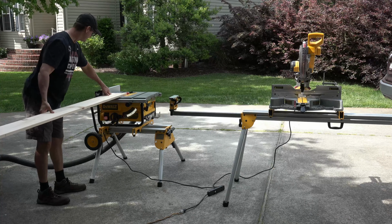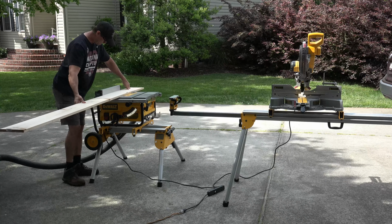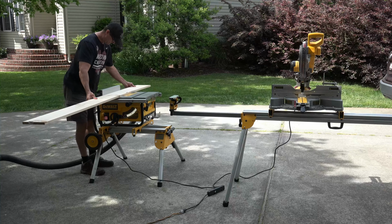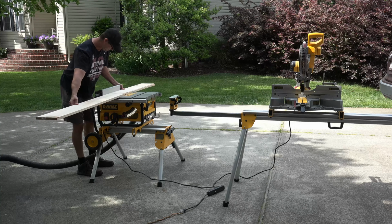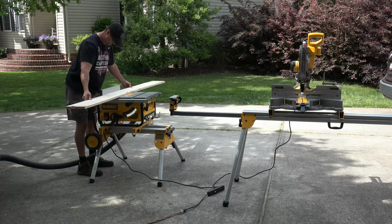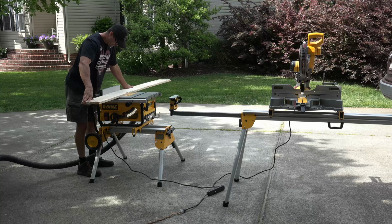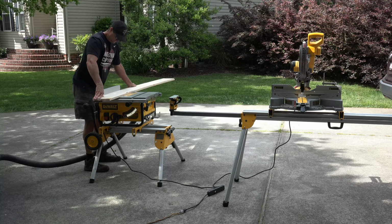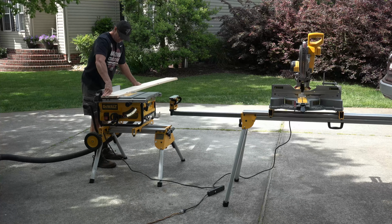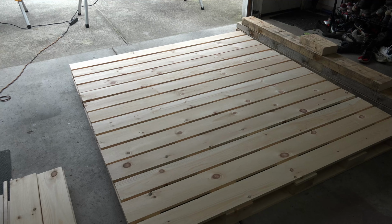When you reach your last board, you can grab your last piece of 1x8 if needed, or if a 1x6 works, use it. I got this extra 1x8 because my measurements actually said I would be 1 inch short, so this piece could be trimmed down to cover both. Don't throw away that extra inch piece because it will actually come in handy, as I discovered later. As you see here, the last board at the head of the bed is slightly larger but not really noticeable.